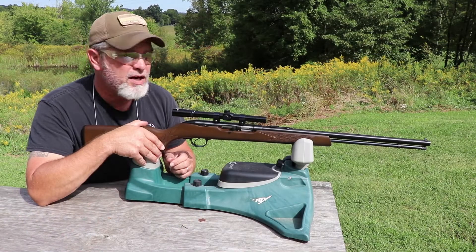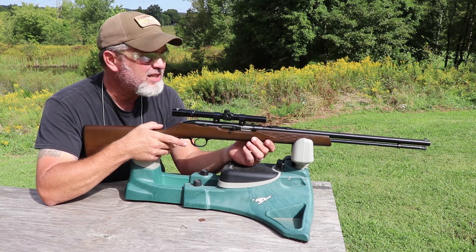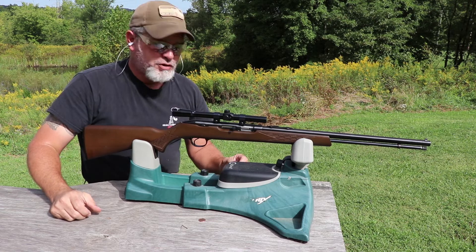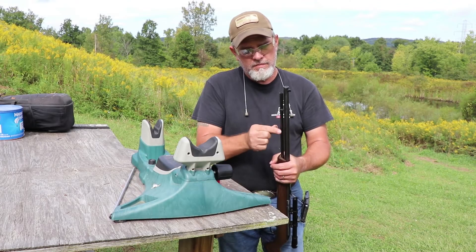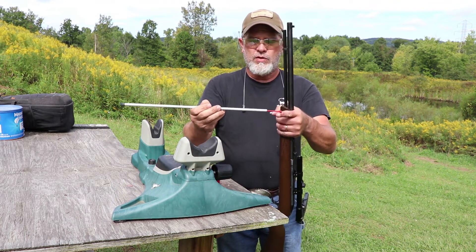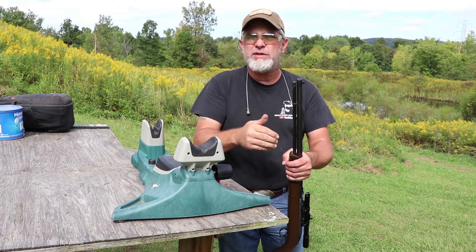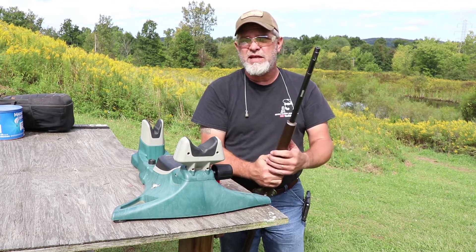This one's in really good shape — not much wear on it at all. One of the things I've read about this is that because of the way the action works, it handles pretty fast cycling well. I'm going to try it and see. Didn't seem to do too bad. Let's throw another 14 rounds in there — 12, 13, 14. Putting the tube back in, this little follower on the end kind of wobbles around; it's supposed to do that, it's not broke. Push it down in there — you'll feel the rounds kind of slide up inside the tube. That tube has a spring that keeps pressure on them, working into the little elevator that lifts them up and shoves them into the action.